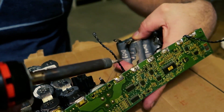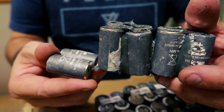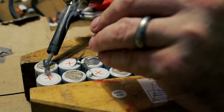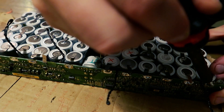As I removed the old batteries from the circuit board, I realized they're wired into packs of 10 — so 10 batteries all hooked to the circuit board putting out 12 volts, and there are six of those in each battery pack. I used a wooden clamp to hold everything nice and tight while I soldered. After a few hours I had my first battery pack complete. I didn't film the second one since I just repeated the same process. Once I had both packs complete, I decided not to seal them up yet in case there were any problems. When I reinstalled the batteries, I heard a faint beep — signs of life! I put it on the charger and went to bed.